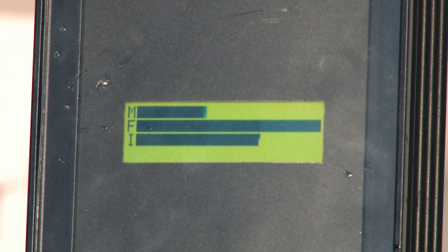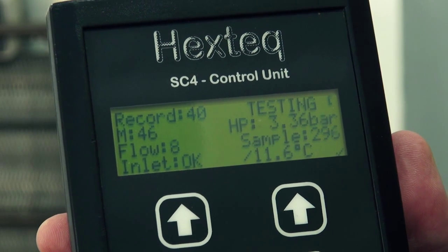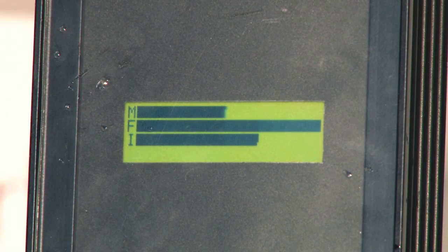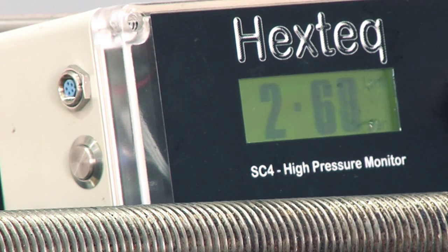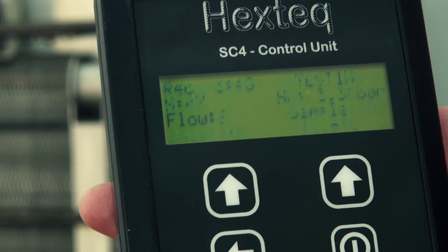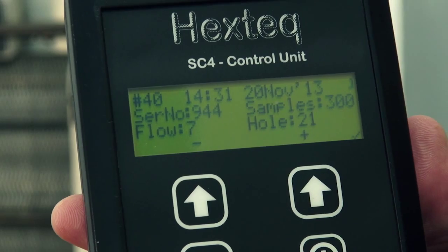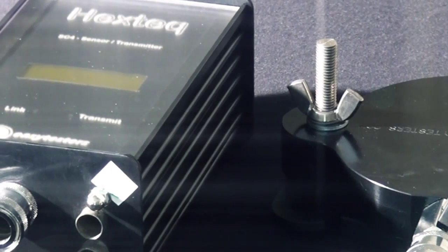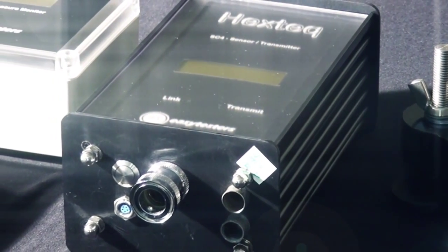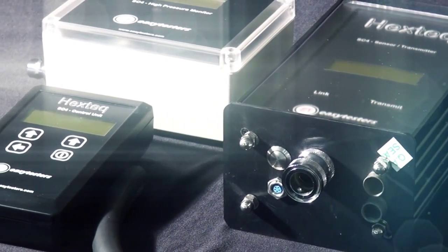Each test is controlled by the hand-held test process controller and data acquisition unit. This component also collects the data from the measuring head and the pressure meter at the end of each test and calculates the flow rate from which an estimation of the hole size is also made. The data acquisition unit can store data from up to 80 separate tests before requiring download. All three items of electronic equipment are linked by wireless communication for data transfer and a GPS unit is also included to provide positional information for each individual test.